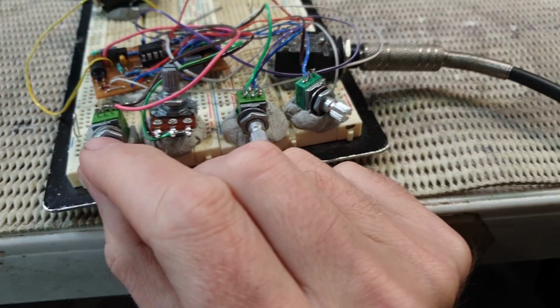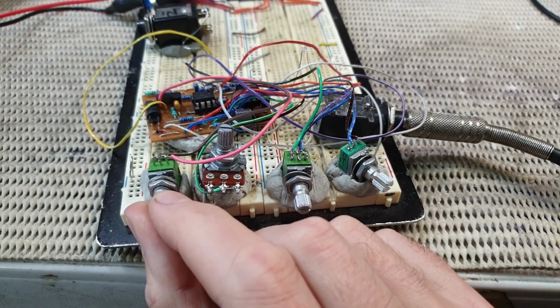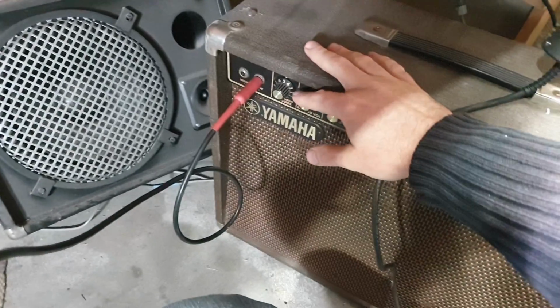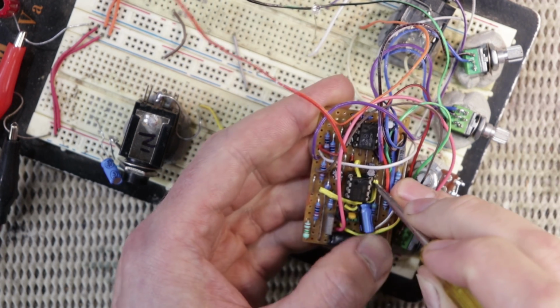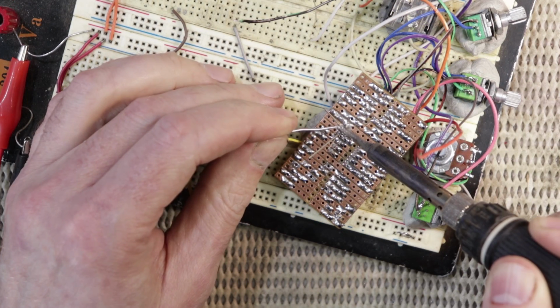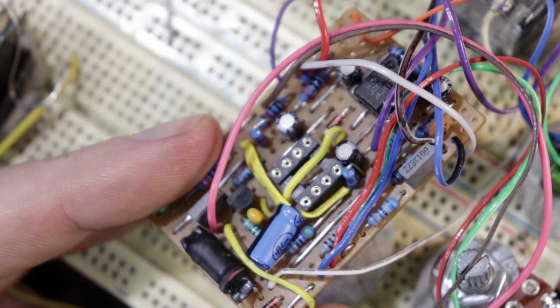But to be honest, these sort of issues with low frequency oscillators are not uncommon, not just with tremolos, but when you're tinkering with chorus circuits and flanger circuits, phasers, synth modules and stuff. It does happen. I did try a few quick fixes on my little board, and they all helped, but the ticking sound was still very quietly there in the background, so I knew I'd have to dig just a little bit deeper.